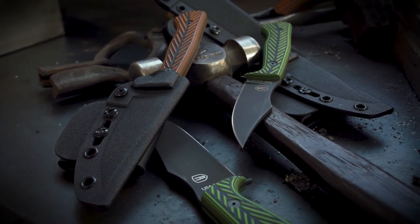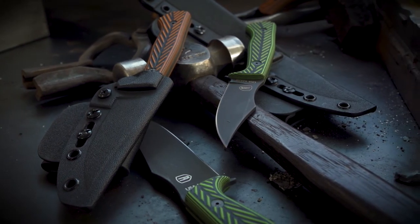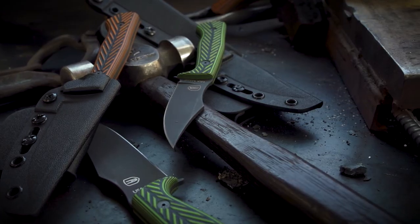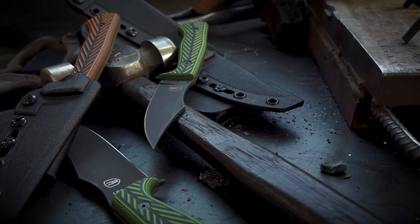The last thing to consider when choosing stainless versus carbon steel is the looks. Some people love that high, mirror polish — you just can't beat stainless steel for a mirror finish. That said, with carbon steel you can put a neat hand rub finish on it if you're a custom knife maker. We use a parkerizing process which actually turns our blades black — not so much for looks, but to help keep the blade from rusting. The parkerizing attacks the steel in a controlled way, turning it black and reducing the maintenance needed.